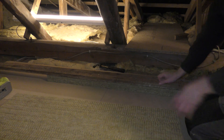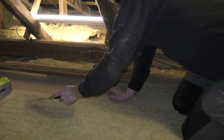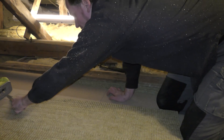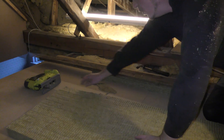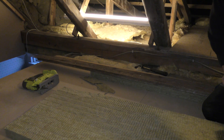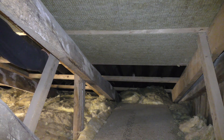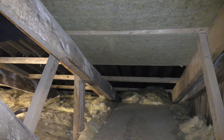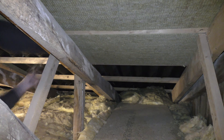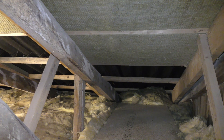I'm gonna cut a little bit off here because I have some roofing that is gonna be very irritating. I just removed the little corner down here so that it should be a lot easier to put it in. The first batt is in its spot and it wasn't too easy. I'll go measure up for the next one.